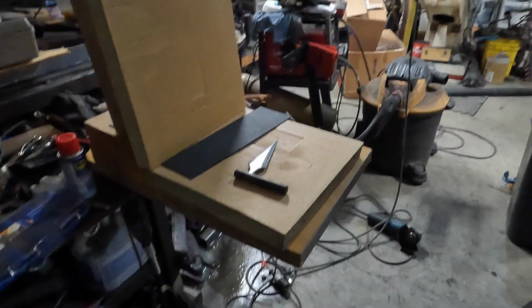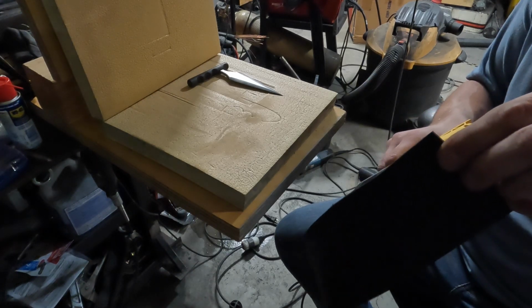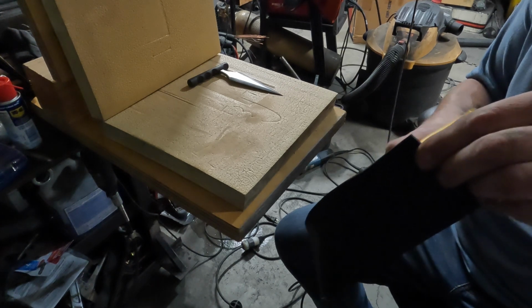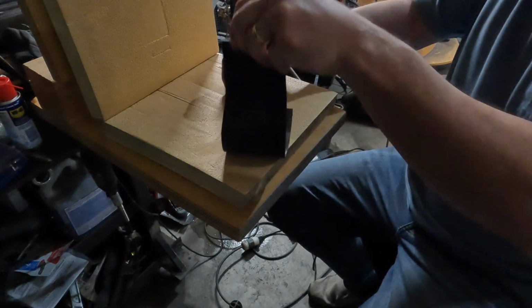But so this is eighth of an inch Kydex. It's called Kydex. I bought it on Amazon, and this is my homemade little Kydex press I made. I made it out of concrete form board material, inch and an eighth plywood. It's very stout. I got some very stout hinges. It's a 4x4 bolted on the back, and this is a very sturdy, cheaply built Kydex press. I had good results. The foam too. It's a special type of foam, and I bought that on Amazon as well.